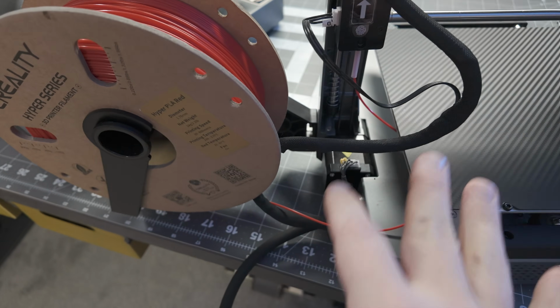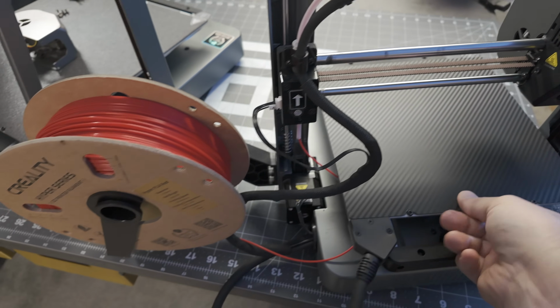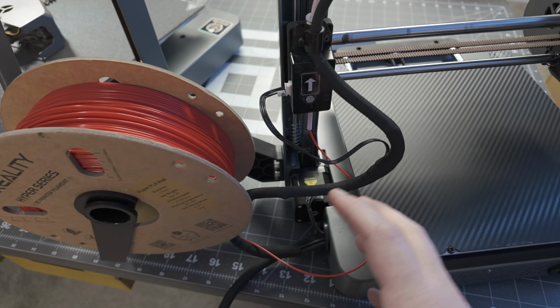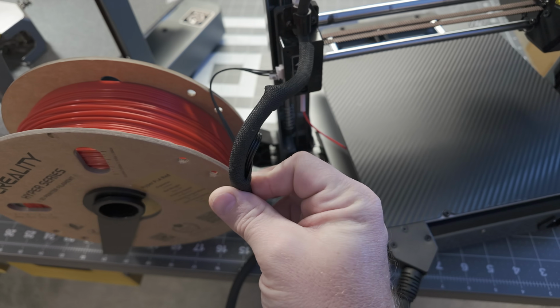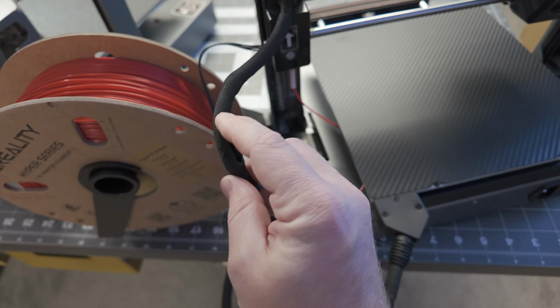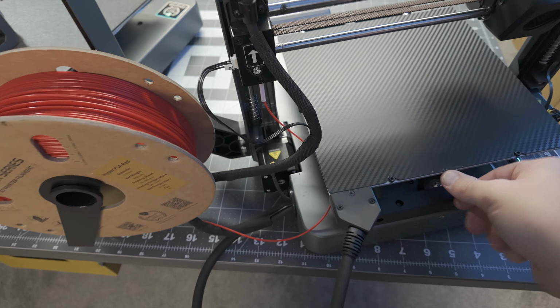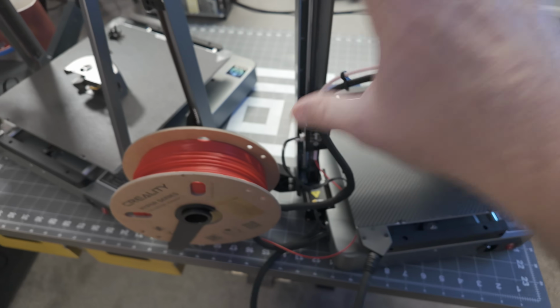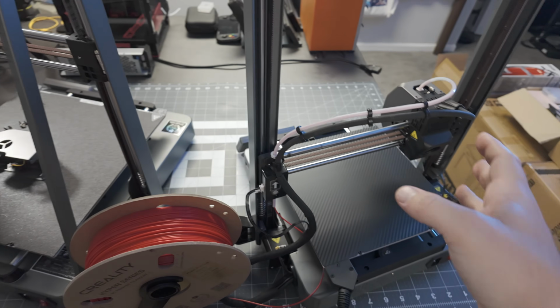And then the machine starts going and it starts printing rapidly, very quickly. So if you didn't catch this, this is just a bit of a mess. And what happens with mine, especially, is we're actually getting some rubbing. There's actually a hole forming on one of the wires back here because it touches the side of the bed. So this just doesn't match the rest of the machine because it is just so clean and fast and good looking, yet this looks a little bit messy.